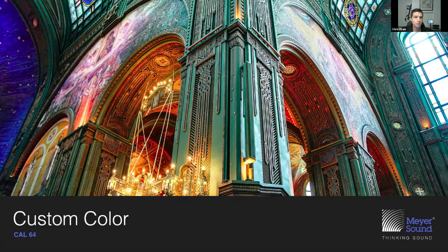a complete package. So the Cal column speakers actually come with built-in DSP that you can access over the network. And the amazing thing about the Cals is they're actually beam steerable. So you can say, okay, I want my audio to be 5 degrees, or you can open that up to 30 degrees and you can move the beam in 1 degree increments up and down. The Cals are an amazing product.